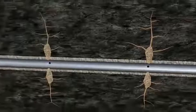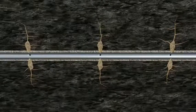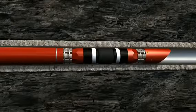These fractures are then packed with proppant, prohibiting them from closure. Once the well toe has been prepared, perforated and fractured, fluid is pumped to hydraulically push wireline guns and plugs out into the horizontal section of the wellbore to isolate the previous zone.